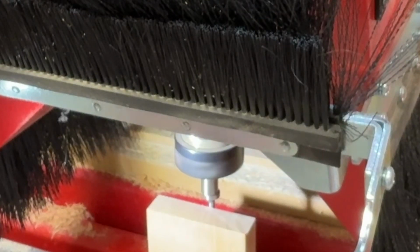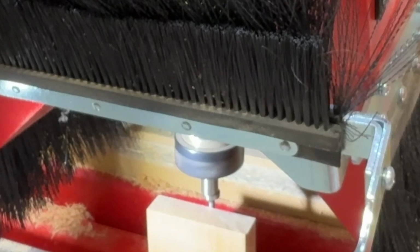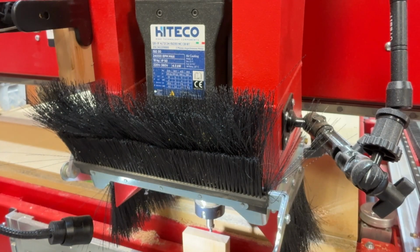So I'm going to back off of that and then step in 1/1000th of an inch at a time until we see the same thing happen. We see that step. Now, it just shifted. I moved forward 1,000th and it shifted. So I know I'm 1,000th too far. So I'm going to back up one step. It will not bounce back to the center because of the way the spring works, but now I've identified where the edge is.